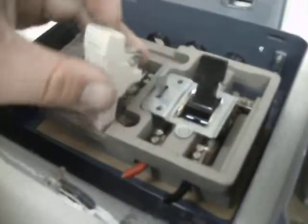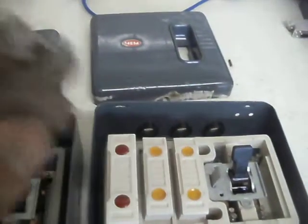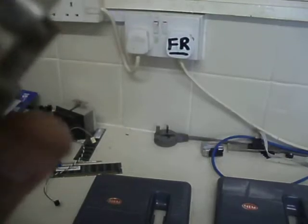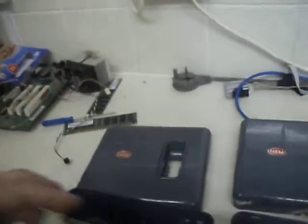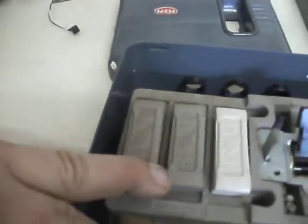And the fuses — they just plug in like that. And they're re-wireable fuses. They do have fuse wire on them. These are 15 amp fuses, whether or not that's the correct wire that's on them, I don't know. There's this one which is a 20 amp fuse — two of those. And red is 30 amp. That's also a larger fuse. Also ceramic.